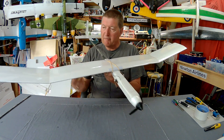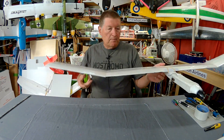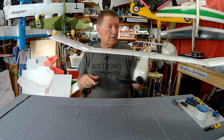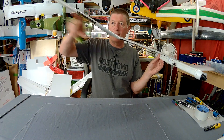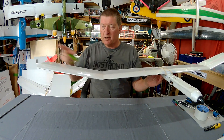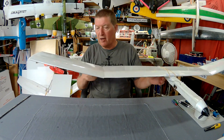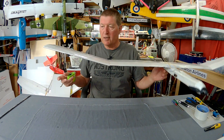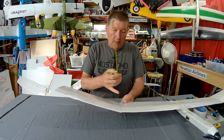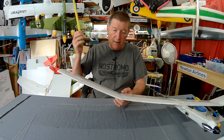I've shown the basics of making these wings in previous videos and I'll put links in the description. It's a 3-channel plane with no ailerons, so it needs some dihedral or polyhedral to assist with turning. The rudder kicks the tail around and the turned-up part of the wing helps bank it through the turn. The amount of dihedral is really just a guess based on experience. I lay the wing flat on the bench, shaped the join so it butted up nicely, and hot glued it together.